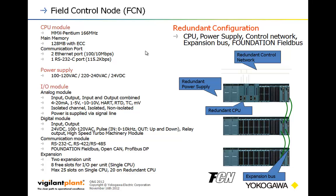There's also a wide variety of digital modules including DC, AC, pulses, and relay outputs. We also have a high-speed turbomachinery module, great for compressor control stations and anything with high-speed rotating machinery. For communication modules, we have RS-232 and RS-485, each typically with a couple of ports. We also have Foundation Fieldbus, deployable up to seven per system and in a redundant configuration. And for remote expansion I/O, we support various slice I/O systems like those made by Phoenix Contact, using OpenCAN and Profibus DP — excellent ways of getting Class 1, Div 2 remote I/O at well pads or smaller installations cost-effectively.